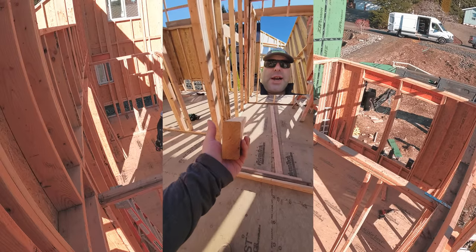Now it's time to nail off the outside corner. Once I nail the tops, the bottoms are nailed, then I nail all the partitions as I go so I don't forget something. If you've seen in previous videos, we always hold that end stud back slightly — that allows us to fit walls in between. Then I'm going to knock all the gaps out, nail it so it's nice and smooth, and that makes the drywaller's life easy. Since I'm short, I just put a nail in my Martinez hammer and I can reach toward the top — with the hammer I can go about eight feet.